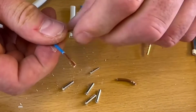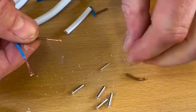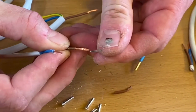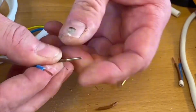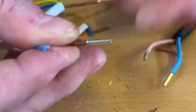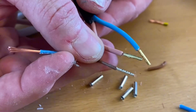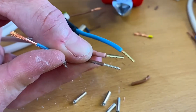Give the conductor a gentle twist — it needs to be slightly longer than needed. Bring in the appropriate size ferrule and get it over the conductors, winding it down. You should have a couple of millimetres of strands poking out the end. With that tube on, bring in your ferrule crimping tool, put it in and crimp it up. You can see we've improved that electrical connection — we're now essentially screwing into what is a solid copper tube rather than fine stranded wires. You often see those in the manufacturer's end of the plug.